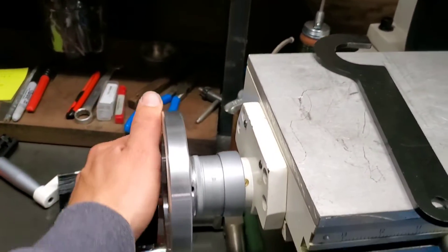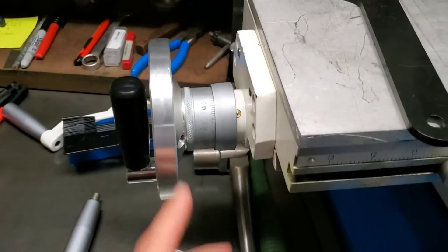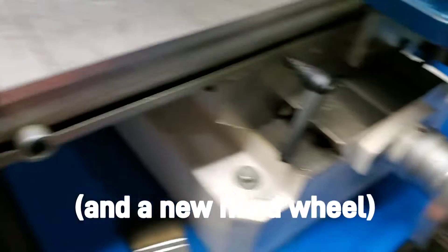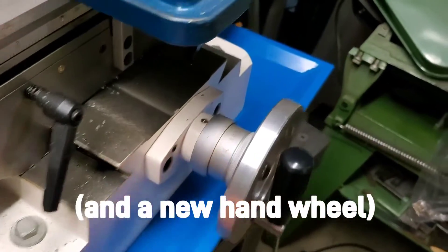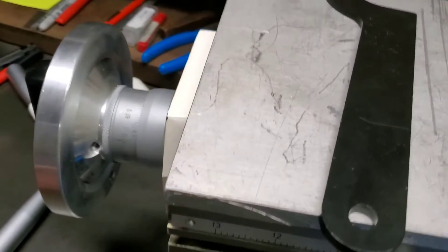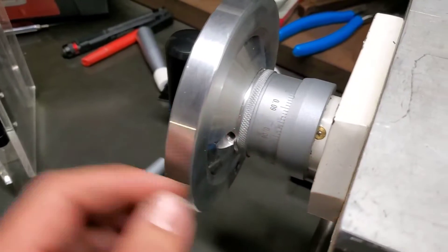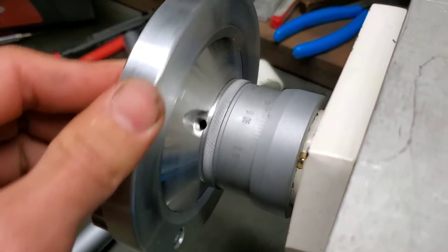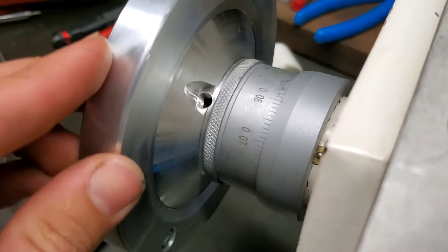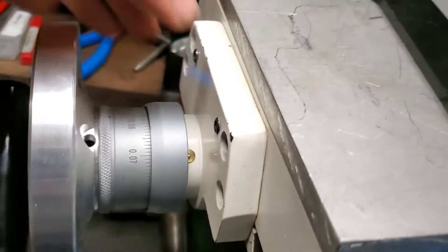The left handwheel did not come with a graduated dial, so I talked to Precision Matthews about getting these two parts — the press-fit sleeve and the graduated dial, the same ones used on the other two handwheels. They said it wouldn't work; that's what the factory said when they tried to order them, that those two parts would not work on the left-hand side. But I knew it would work if I installed a set screw, so I had to mill out a little spot for one. That tightens it down onto the arbor, and now it works great.